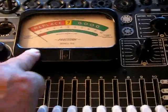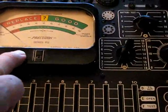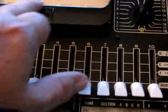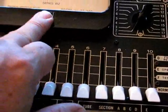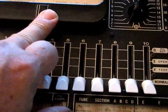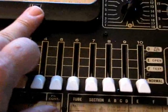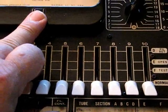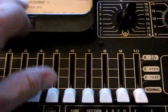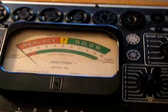Consequently, I had to take the meter out and take it all the way apart. One of the things I found was I had to clean where the coil sits into the pot metal. The pot metal had corroded over the years, and the plating around the meter housing had started to flake up, causing all kinds of problems with that coil. I did get it cleaned out to the point that it was working and no longer hanging, though I may have to go back in and do a little more work.